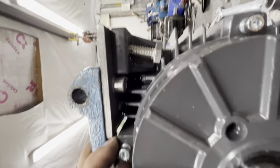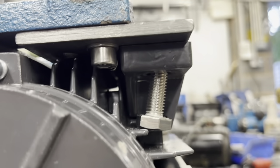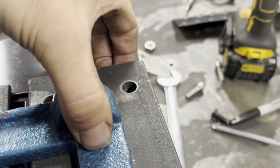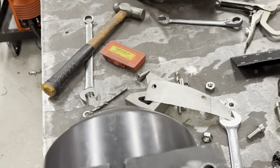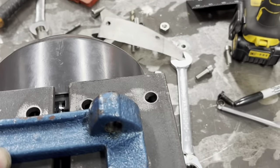The washers are catching, so I need a washer moving — otherwise it won't go over. This one must also be catching. I'll find some different washers. All right, that's on. So we've got two plates, six mil thick, realigned the holes, did what we had to do while countersinking this one — the other three are cup heads.